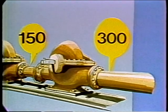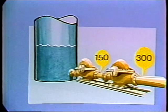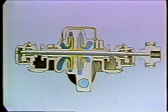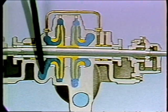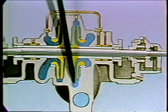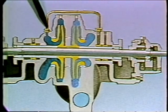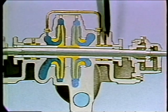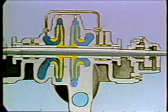This may not seem exactly right at first glance, but just take my word for it — the pressures do add up. In actual practice, we usually use a two-stage pump like this, with two impellers in one housing. Fluid comes in here and discharges to the suction side of the second impeller, where it is boosted up to its final pressure. You will notice the bleed-off line right here, which goes back to the suction side of the first stage to reduce the high pressure on the second-stage packing. Three or more stages are possible depending on the final pressure desired. This ends part one of centrifugal pumps.